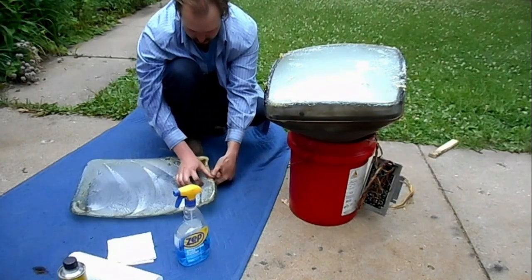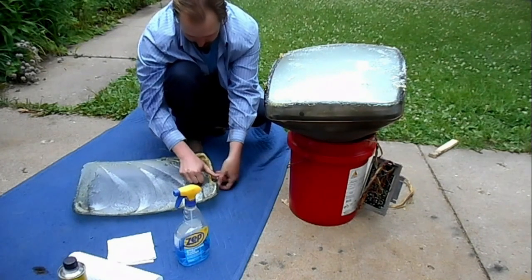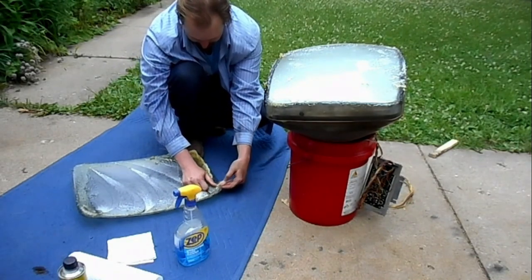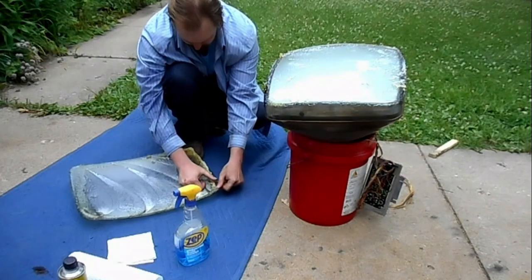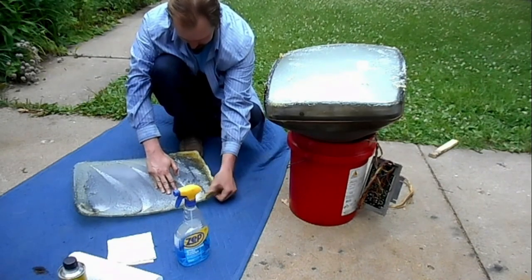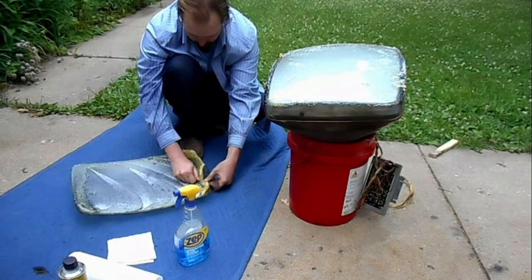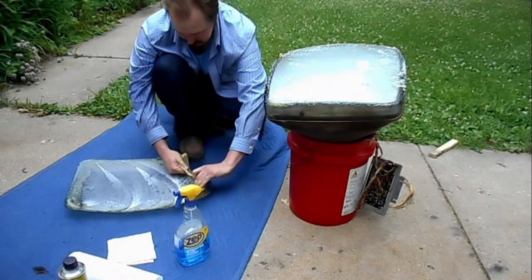These Zenith types tend to turn into goo when they degrade. And they tend to be soft, especially on the edge, but the entirety of the PVA will be soft on the Zenith types. RCA style, the PVA is hard, kind of like a lightly flexible plastic, versus this, which is sort of like a vinyl pool toy material. In fact, the Zenith style smells quite a lot like a brand new inflatable pool toy while you're doing the cataract removal. Hoping to get this done before the impending, what sounds like thunderstorms, start dropping rain on me.